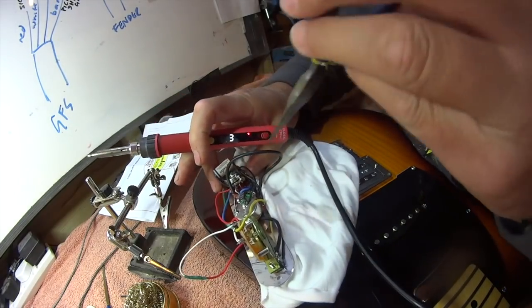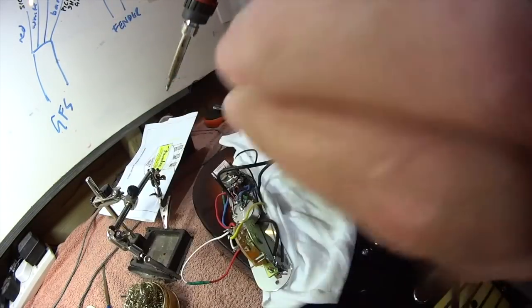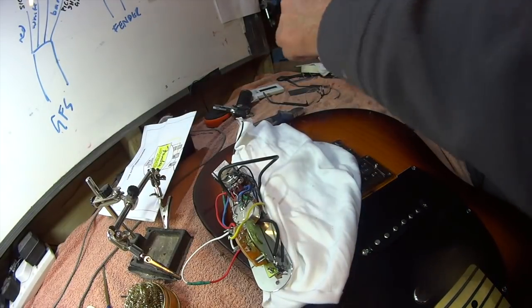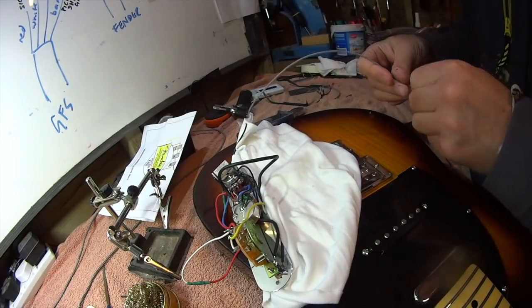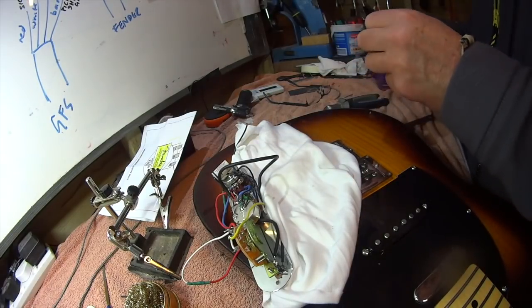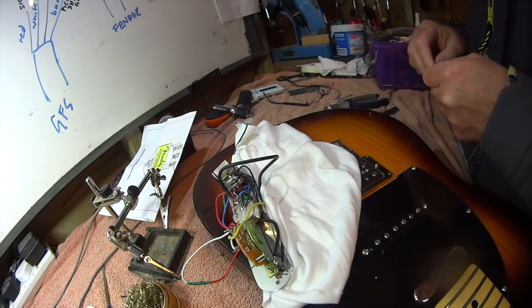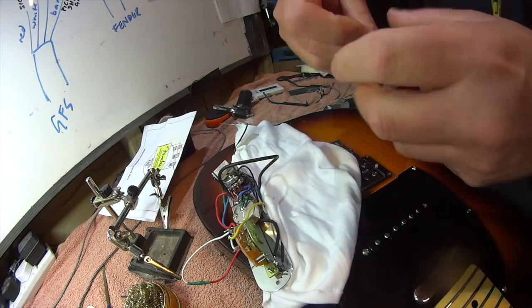So for the purposes of this, I need to unhook this bit here, which now comes away easier, and I'm going to start with this nice freshly made wire. I've bought loads of these 2-core wires. They come in these little pre-cut sections, both ends are cut actually, so theoretically, if you need a long piece, you could just use them all at this length, which obviously I don't. But it's a nice quality wire. So I'll start with this, and I'll replumb this into the output from the jack plug, and then I'll run it out to the jack separately, and we'll take the jack off and remove that old wiring. So first thing is we'll just tin this up a little bit.